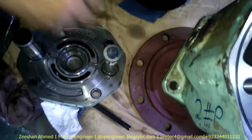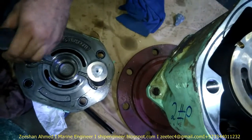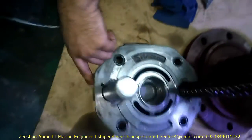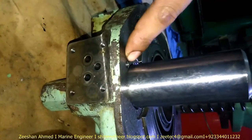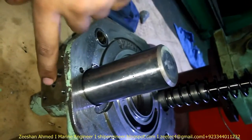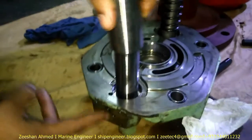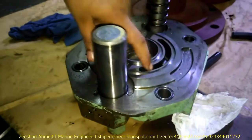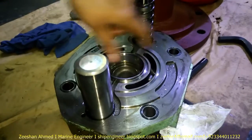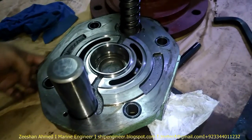These two will change. There is a spring also here, and there is a port here — three ports. This one is linked with the discharge port, the casing of the pump. This one is linked with this piston; if you block it, there is a vacuum created. And this one is linked with the discharge of this pump. This port is discharging because the diameter is small, and this one the diameter is large.